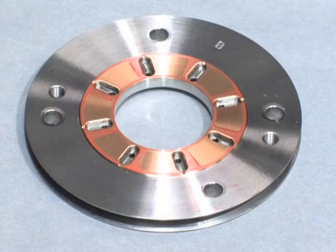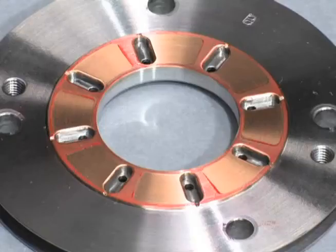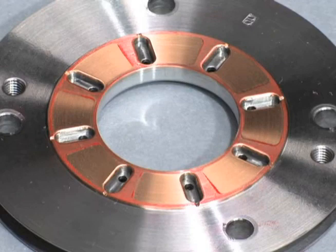If the red paint contact check shows that the ratio of the length of the tapered land to the length of the flat land is 2 to 1, replace the thrust bearing with a new one. Replace also if it is assumed to reach the limit of use by the next inspection.